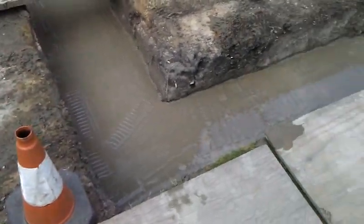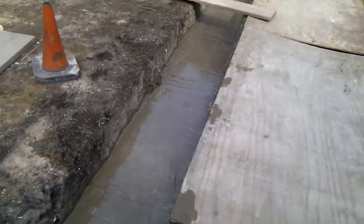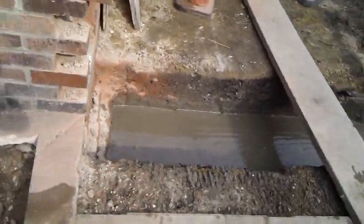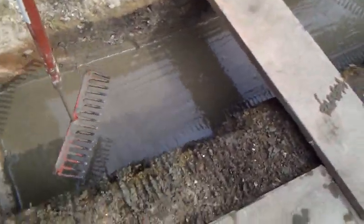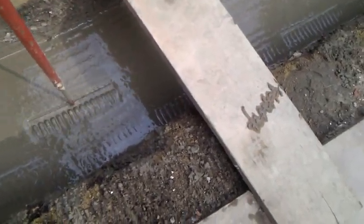Make sure that it's a decent amount of concrete and it's a good concrete that you're putting into the foundations. The easiest way to level concrete foundations is to get a rake like this and start dabbing it in until you find the top of each peg.